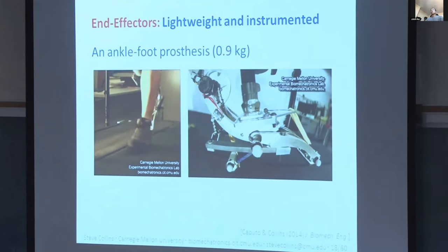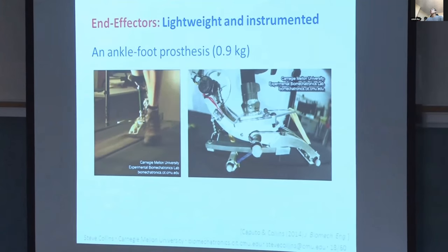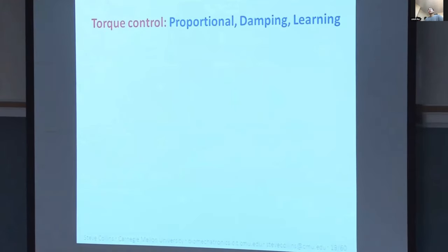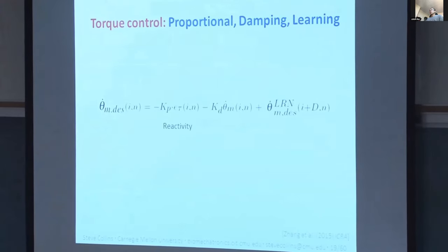And it corrects the kinds of torque errors that tend to occur at the same point on every step. We performed a bunch of tests. I won't bore you with all the details, but they verify the mechatronic performance of these systems, like torque measurement error, step responses, closed-loop torque control bandwidth, disturbance rejection bandwidth, peak velocity, peak speed, and the quality of torque control under a wide variety of circumstances during interactions with people. And by all of these measures, we find that our systems indeed have exceptional performance.